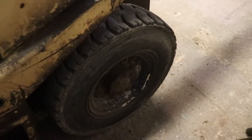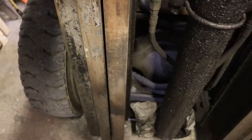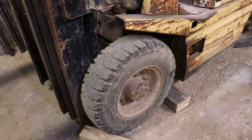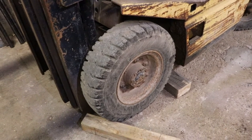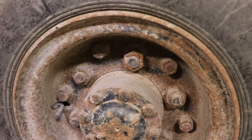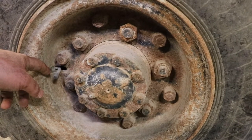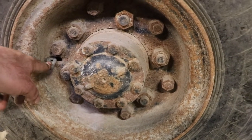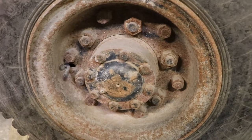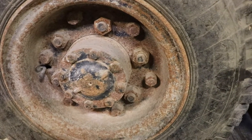It's got a full floating front axle with the diff located in there and a good sized pumpkin. It's got drum brakes on the front and no brakes on the back. These are a style of split rim, and because I've not worked on this before, what I'm going to do is let the air out of the tires before I separate them from the machine - because I don't want to kill myself and I don't know which bolts are which. You'd think that the dangerous ones would be facing backwards, but they're not.